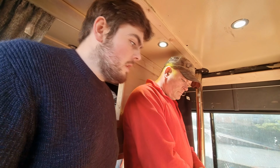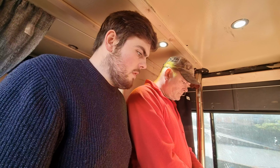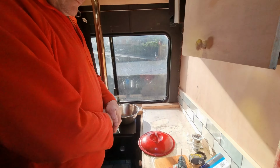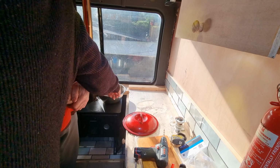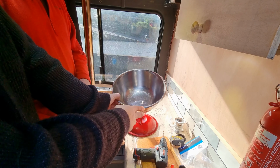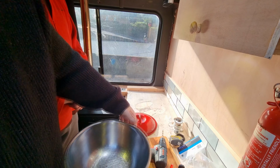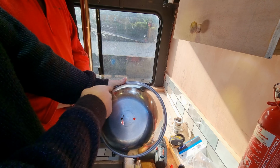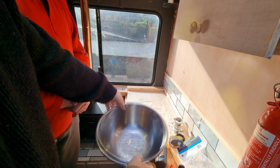Anyway, we're going to actually cut the hole for it in the tabletop, the countertop. For this, we've got this, which is the same diameter as that, so we can trace it out. The lip is like 11.5 inches, but this is 10 inches, and that's the diameter before the lip, so then the lip will hold it in place.